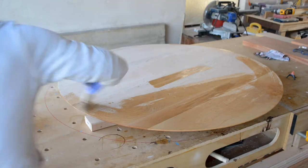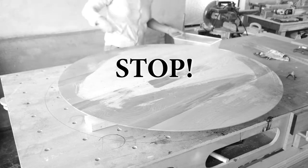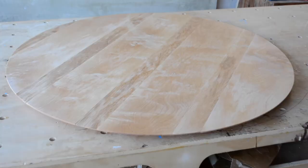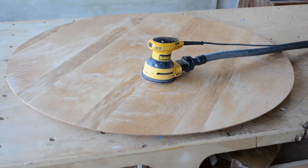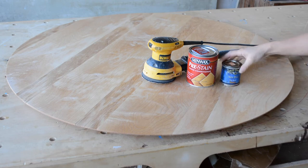Finally, I get to the top of the circle. I like to stain, but don't do what I did, especially if you're working with maple — use wood conditioner first. The finish turned out really splotchy, and I ended up having to sand it all down, pre-finish it with pre-stain conditioner, and then apply gel stain on top.